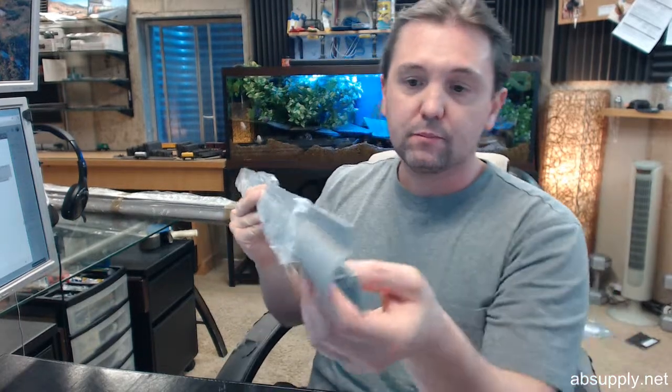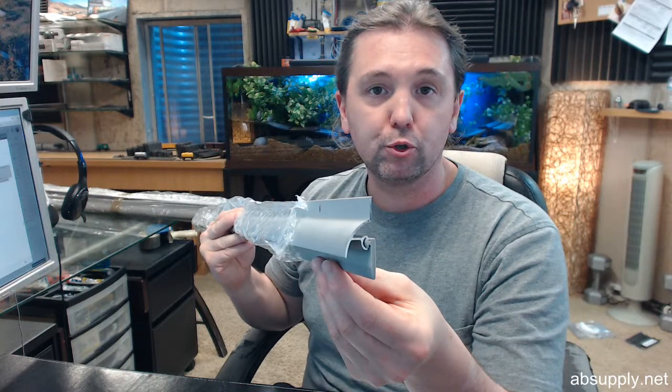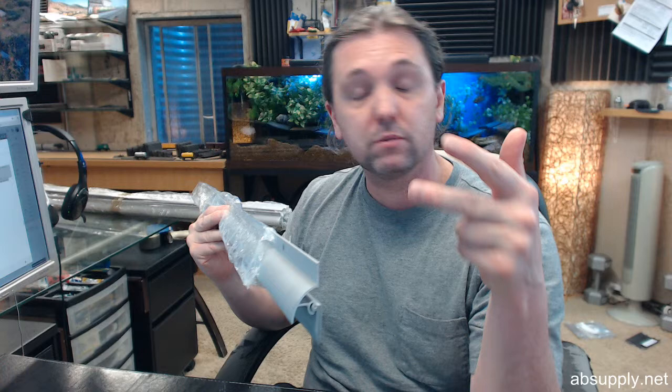Now, vinyl is not the best choice at all for weather stripping. In my opinion, it does not hold up with exposure to ultraviolet, typical sunlight, nor to extreme temperatures. But it is true to say that vinyl is the most common seal material there is. If you have a chance, you always avoid it. Silicone, neoprene, and certainly polyurethane are all superior to vinyl. But there are times when vinyl is what you're using. Could be for economy, that sort of thing.